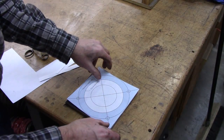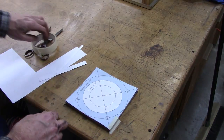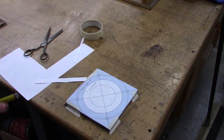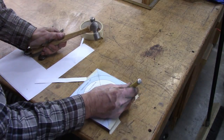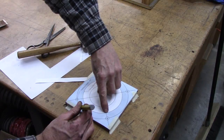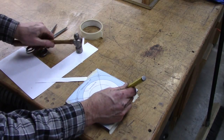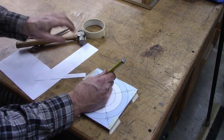What I'm going to do here is show how to cut the motor mount out on your lathe if you don't have a mill. Print out a template and cut it out. Now I'm going to transfer the holes — 3/8 holes — marking the center, and I'm going to transfer the four outer corners of that circle.